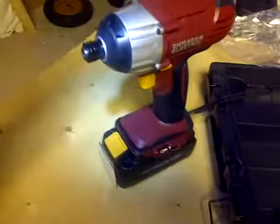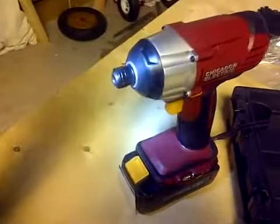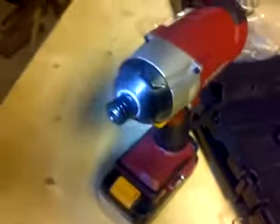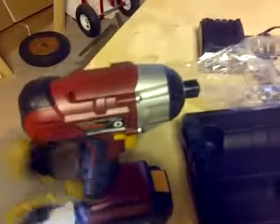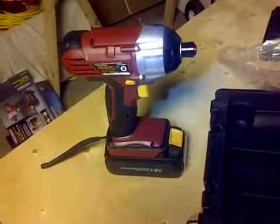As I mentioned before, the impact driver can literally drive whatever you're trying to screw or bolt in all the way through. Whatever you're trying to do, it will keep on going until it just can't go anymore. If it can go all the way through your lumber, it will. That's the difference. The torquing will just keep going and turning in a way that it won't strip out the bolt or the screw. That's what the impact driver is really good for. But then again, you see there's no torque functions on here like the drill. So the disadvantage is if you just want to take the screw to a certain depth, you can with the screwdriver. You can have it flush to the lumber or plywood, or have it stop at a certain resistance.